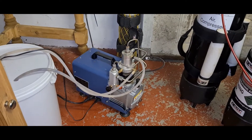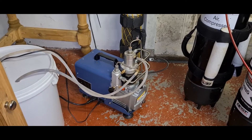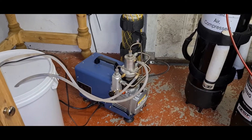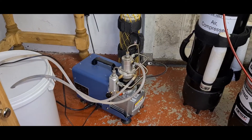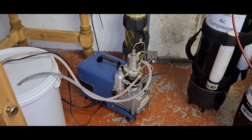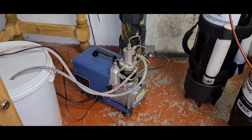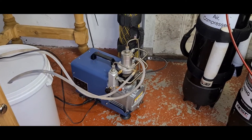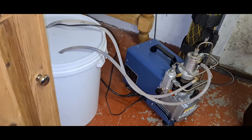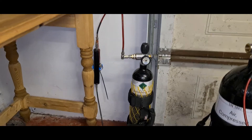Keep it running cool — no more than 10 minutes at a time. Some people are running these for 15 minutes, but they're putting on modifications: bigger flow-and-return water tubes to make it cooler, fans on it and stuff. To me, you're kind of defeating the object of having a cheap Chinese compressor. These things work within their parameters — you don't want to be pushing it too hard. Just get yourself the Air Mega filter and a big bucket of water; the bigger the better, because it's going to stay cooler for longer.